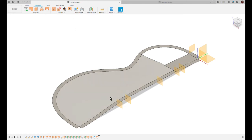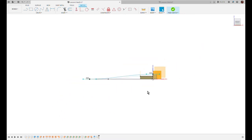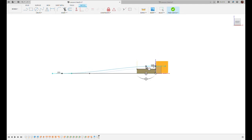Okay, I didn't do the flatter surface there. I can do it. Let's do it right now because it's fun to be able to shape it faster after. So let's create our usual intersection. Okay, and our spline. Okay, let's make it horizontal and let's make it just flatter like this, 10 millimeters more. Okay, you see it's interesting.